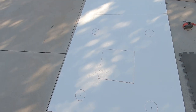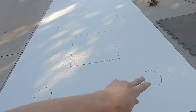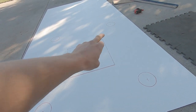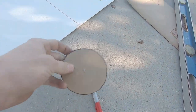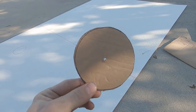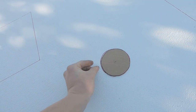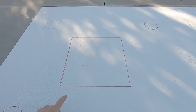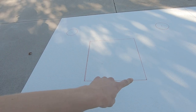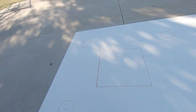I've got the layout for the ceiling portion done — four lights laid out. I made a small template of what the diameter of the actual cutout needs to be, and there's a little trim ring that goes around it so it'll sit nice and flush. There's also a cutout for the vent fan on top. I'm going to carry this over to the jigsaw and start cutting it out.